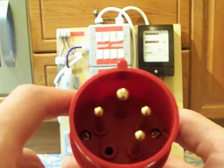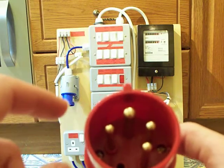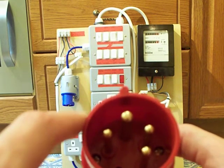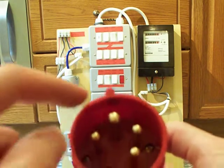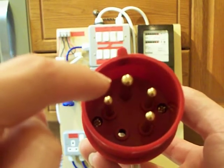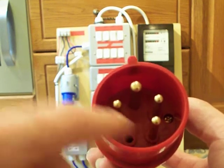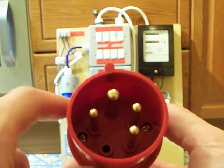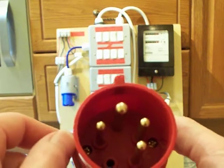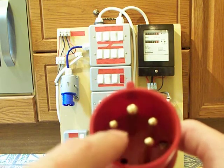I could have used a four pin red plug but those are really meant for three phase only — you get your earth pin and then three phases. I was looking for one that has an earth pin, a neutral pin, and three phases. The earth pin is at the top. One of the pins supplies isolated 240 volts and the phantom currents, one pin is the return for the phantom current, and another pin is the neutral for the isolated 240 volts. In standard mode, one of those pins wouldn't be connected into the coupler, meaning only the other three supply full current 240 volts.